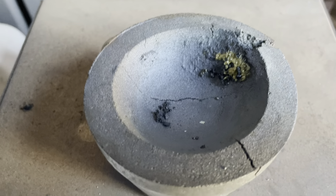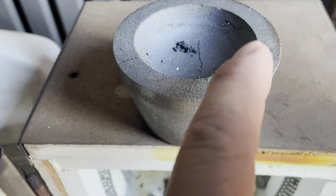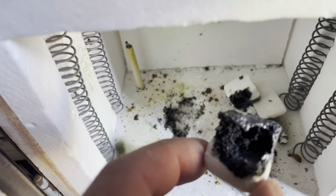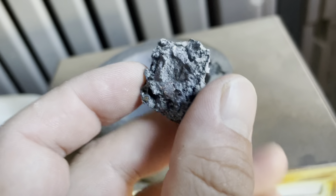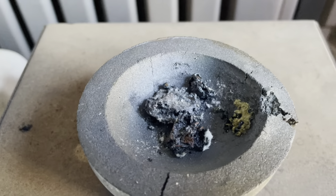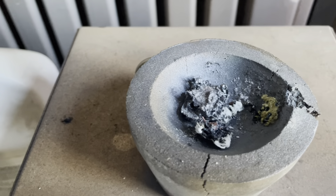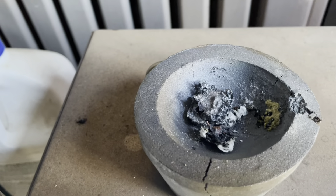That is the result of our cupel last night — nothing. However, I think we had a cupelation failure. I haven't seen them crack that bad. This was really, really swollen right here. And there's a big old puddle underneath where this cupel is sitting — that should be in the cupel, along with that and that. There's probably some more down in this little hole I've been digging at. So, total cupel failure. It was working, it was doing its job, but we just basically cooked it too long in the oven — got it too hot for too long. That's my assumption anyway. I need to figure out something else to do with this. You're going to have to stay tuned for the next video to find out what.